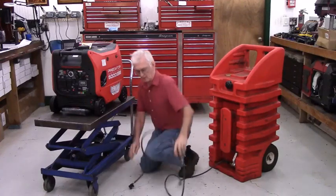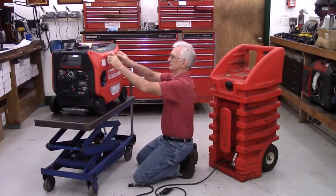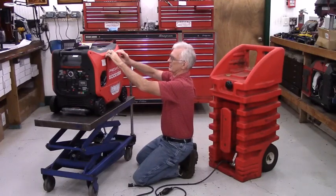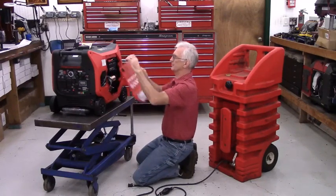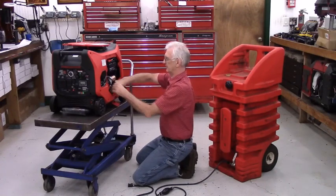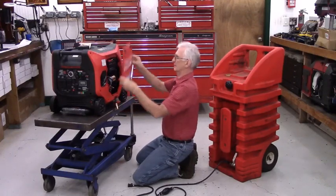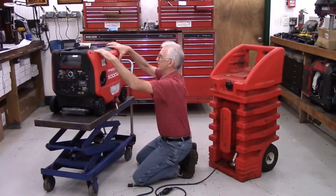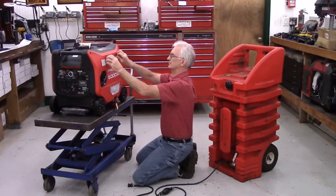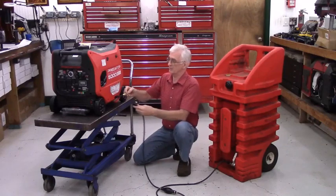On this particular generator I have hidden the fuel inlet port on the inside — it just lends itself very well to doing that, and that way the generator has a nice clean look from the outside. What you'll do is open up this side cover, then open up the oil drain hole, take the fuel line and drop it out through the socket. You can then put the cover back on because the generator is much quieter with the cover on it. Then hook the generator end of the fuel hose to the generator.